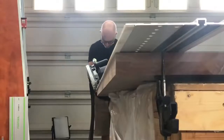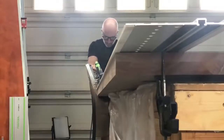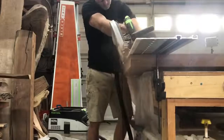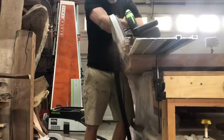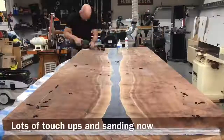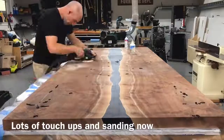You can't really get router bits this big, so I had to come up with a system to cut these chamfers with my track saw. It's a pretty slick system I came up with by overlapping that track just slightly over the edge. If you want a detailed description on exactly how to cut this edge profile, I have a full YouTube video on that and I'll add a link in the description.